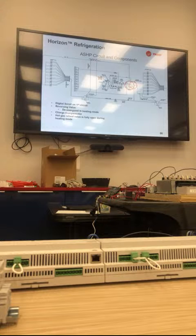it's a mechanical device that we use. In cooling mode, if this is my discharge line, this is a vessel. It's a shell and tube heat exchanger for the most part. If I'm in cooling mode, this pipe gets hot, causes this vessel to heat up, and then pushes any liquid that it holds into the liquid line.